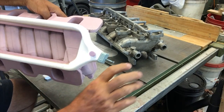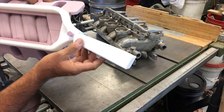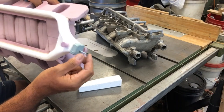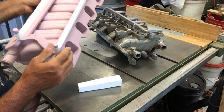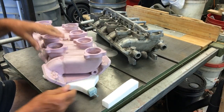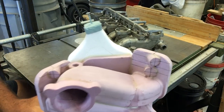with the Y and the runner system, and I'll just attach that right before I fill the mold with hot melt, because if you put that sprue on the end out there it's just weak and going to break off. And instead I cemented on this little wooden button here and glued that on with hot glue, and I've got a screw in the end there, and that's what I'll hang it from when I dip it. So it's a drastically simplified gating system for it, and it will be positioned up and down this way. So with the snouts here facing down, pointing like this, and there's the gate system.